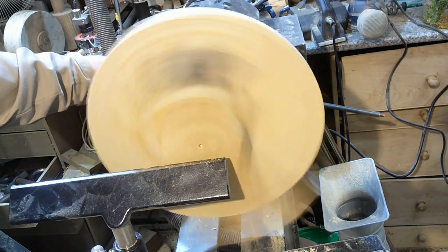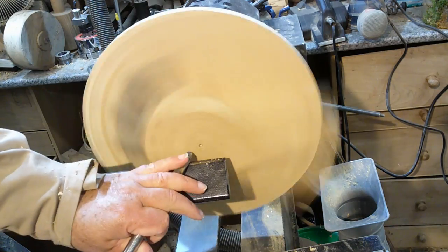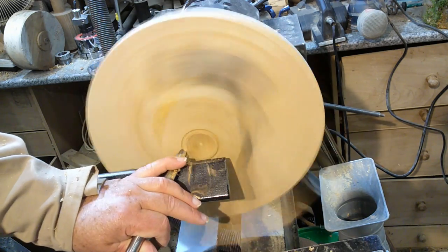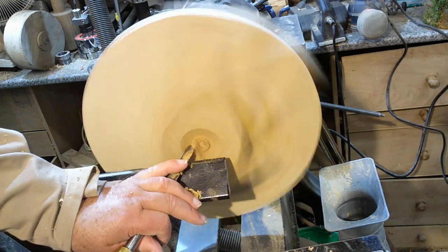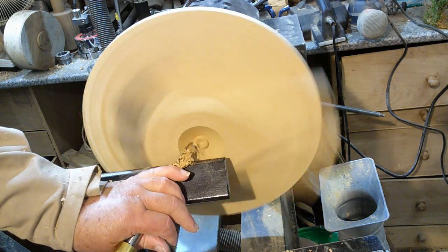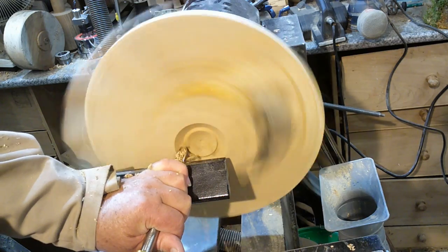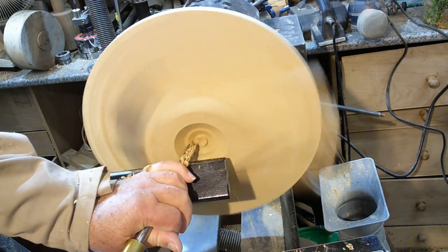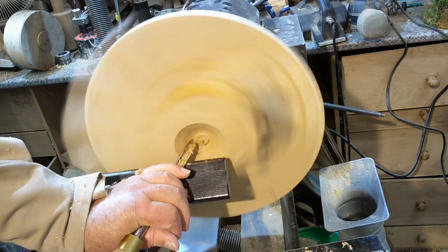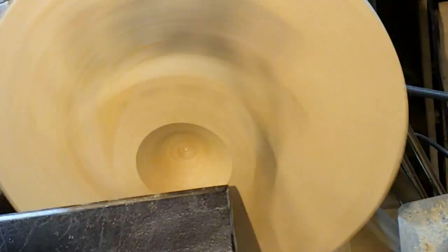Because it's on that backing plate, you don't want to be turning the lathe up too high. I've got about 600 revs, which is enough just to hollow that out. Here we go - we're getting to hollowing in the actual bowl. This is just turned as you would any other bowl, just standard bowl. The only thing you have to be careful of is not going out too far, being very conscious of where the edge is. We were aiming for an 80mm bowl.